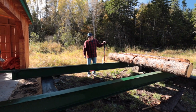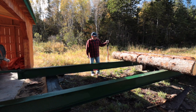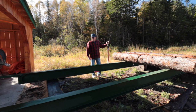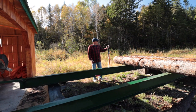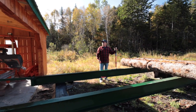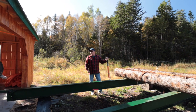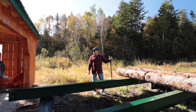These beams came from an old bridge. The guy that built the ramps salvaged them and when I asked him about helping me make a set of ramps, he came up with this idea and made the little fold-down parts — really great for me. I can put 10 or 15 logs on this deck using my log loader, which is a trailer on the back of my tractor with a boom. I can put the logs on from the side and don't have to come anywhere near my mill, so there's no danger of damaging the tracks or the mill shed. A lot of people use their machines to drop the logs onto the rails — I don't think that's going to end well because after a while you're going to damage something. This way everything is rolled on and there's no real chance for damage.